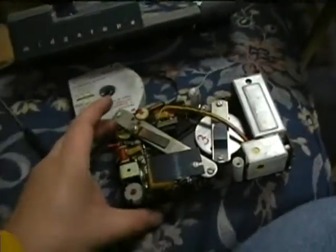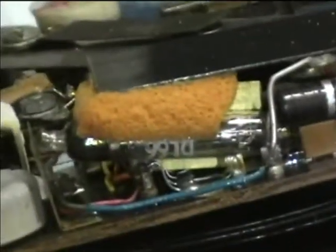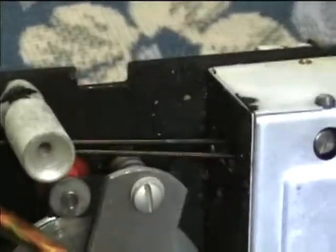Here's the inside of the Mohawk Midget tape recorder — it uses subminiature tubes, which you can see here. Looks like somebody did some re-soldering on the wires to the tape head. There's a tiny audio transformer here. Down here I think is the motor — power is transmitted through a metal belt up to a flywheel under here, and then via a rubber belt to the take-up reel drive.